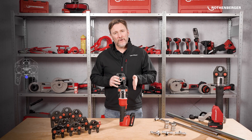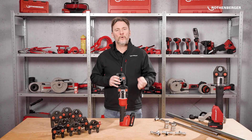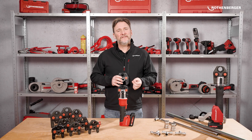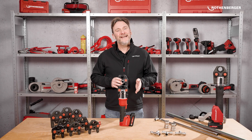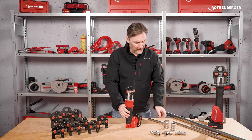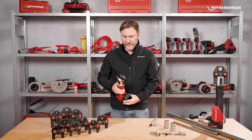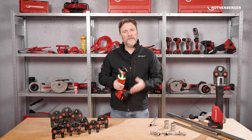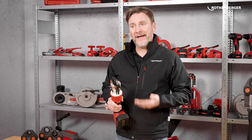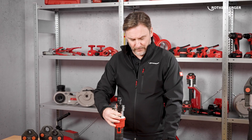The iJaws are also smart. Each press jaw has a small RFID chip. Once inserted into the Romax Nano, the machine automatically detects the jaw type and sets the exact required press force. This ensures the fittings are pressed with optimal pressure and the machine can also save battery. Here I have an SV18 jaw and a pipe with a fitting. One button press wakes the machine and the LED ring briefly flashes green — that means the jaw has been detected and now we just insert the fitting and start pressing.